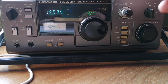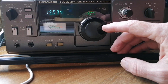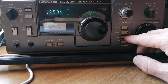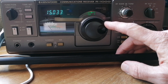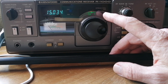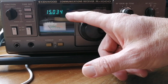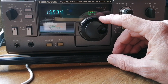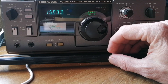There were three things that I needed to do. Number one — I switched it on. This is Trenton Volmet, but we're not going to hear anything now because it's daytime. I would tune to the frequency like this, select USB mode there, and then maybe just briefly try to fine tune like that. Now that is the first thing I did wrong. The fine tuning on this one is so sensitive that once you have your Volmet frequency displayed on the screen, you need to barely touch this dial. You need to tune very, very finely, and then it is possible to clarify the signals quite nicely.